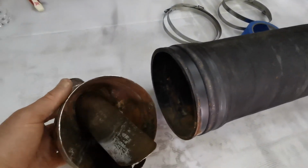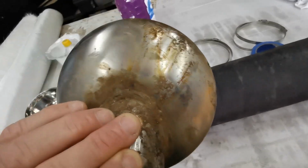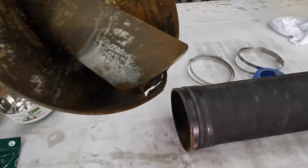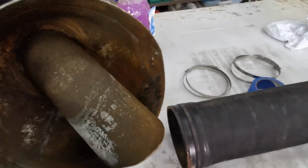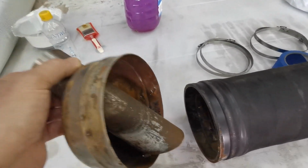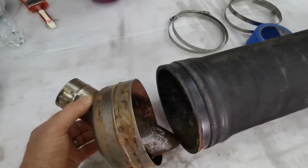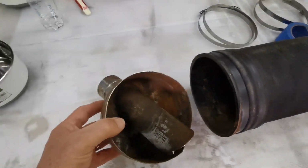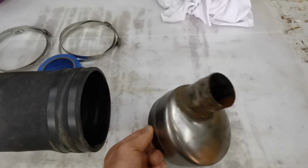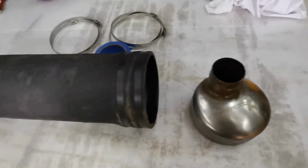Okay. The problem with stainless steel is it corrodes, becomes very weak and then starts leaking. There's more holes, and that's the problem I've been having. It's been leaking water into the bottom of the boat. So I'm going to replace these two end units with composite units. I'm going to make fiberglass replacements.